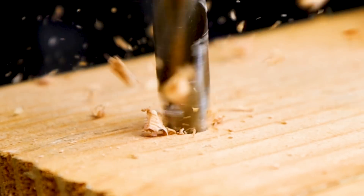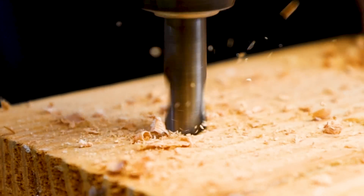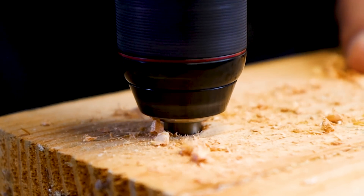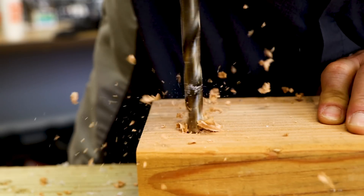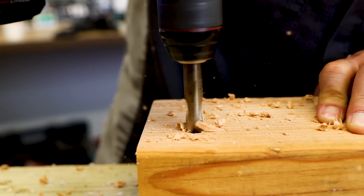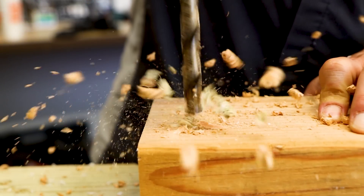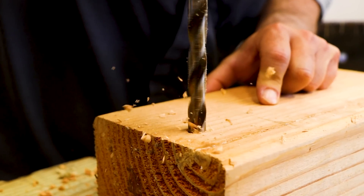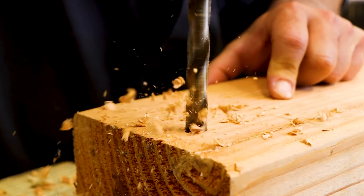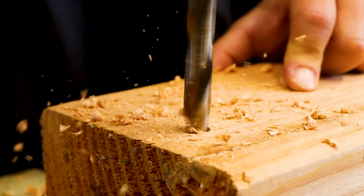High speed, or speed two, really comes into its own when drilling through wood. Twist bits — I know what you're thinking — they do such a great job with metal and plastic, but are they really good at drilling wood? They are, because of that very sharp cutting head. And there's another feature I touched on earlier that makes them so good, not only for shallow holes in thin wood or two-by-fours, but deeper members as well.